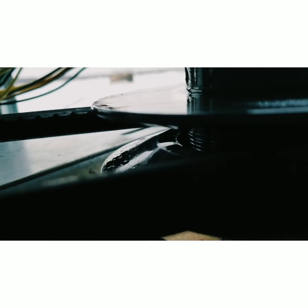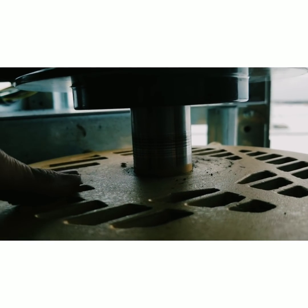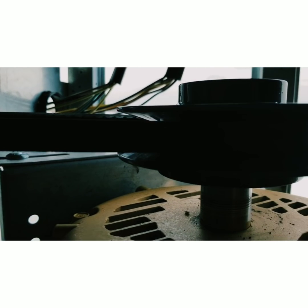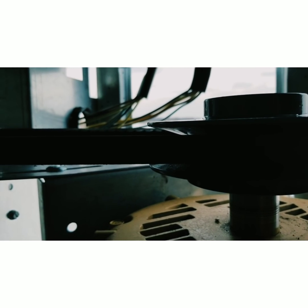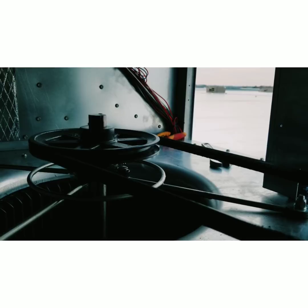What also happened was the set screw came loose on this pulley right here. This is an adjustable pulley — you can see that by the threads inside — so we can adjust that bottom piece down. Because the set screw came undone, that bottom piece wound its way off and was just sitting down here, and the belt was off. The alignment was out of whack, the bottom adjustment had fallen off, and the belt was sitting right in the unit.